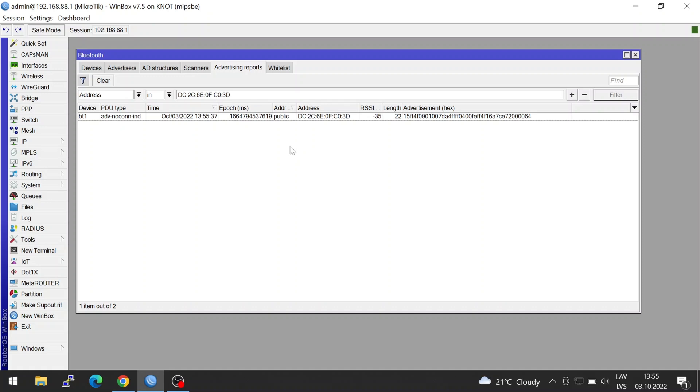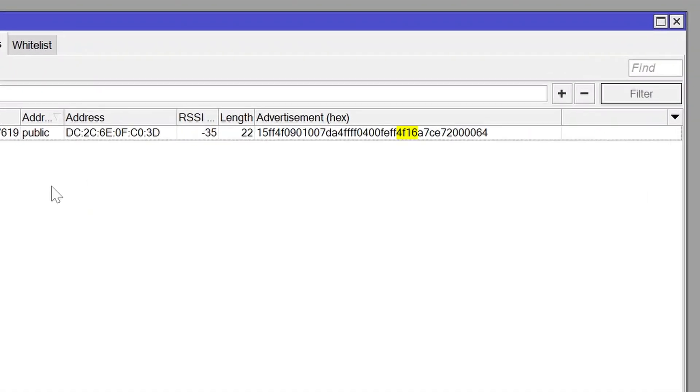They are in hexadecimal format. The 14th and 15th octets of the payload indicate the temperature that the sensor detected. To convert the temperature to a decimal value, you need to keep in mind that multibyte values are in little endian, and also that the temperature in Celsius is in signed 16-bit integer, two's complement 8.8 fixed point format.